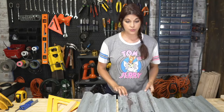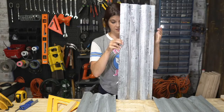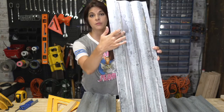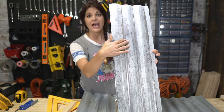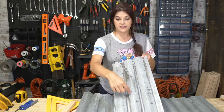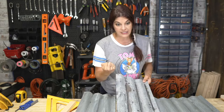So I did a couple different levels. You can see that this is the most rustic looking one. A lot of the rusticness happens in the grooves here, because that's where the muriatic acid sits. You're also going to notice that your sponge very quickly starts to disintegrate, and it starts to leave sponge parts all over the place. I say leave those sponge parts, because that's how you get these little polka dots in here, and it's those sponge parts that just sit there eating through it.